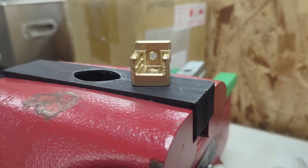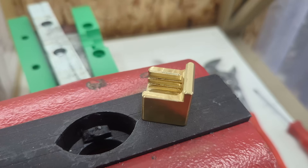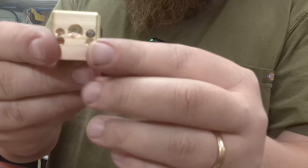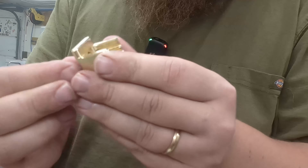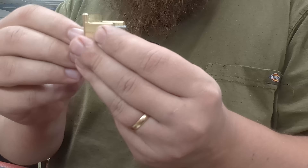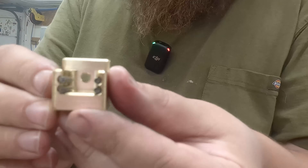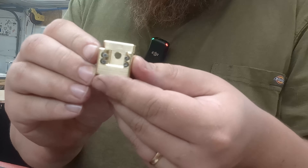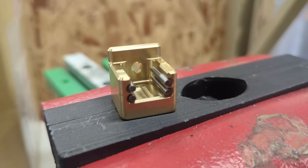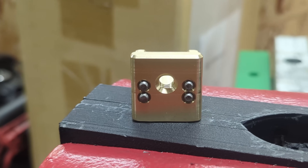I should probably measure it even though tolerances on this thing don't matter since it's just a test part. The process was pretty quick and easy, and with some creative Scotchbrite work you can't even tell that I didn't machine one of the sides. Let's see how our pins do. That one is loose at least — I was hoping for a press fit but I knew I was using the wrong reamer. Honestly, maybe if I used a retaining compound like one of the Loctites that might actually work. When this thing is in action those pins are going to be held in place. My pins are also a little bit too long so they hang out on the back a little bit, but it won't hurt anything.